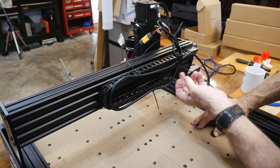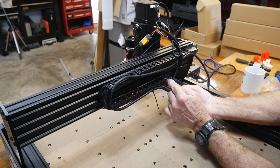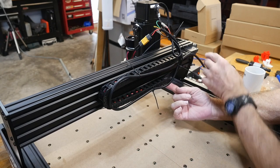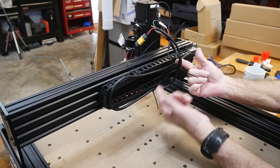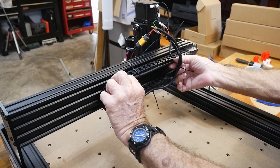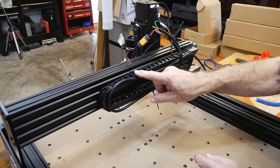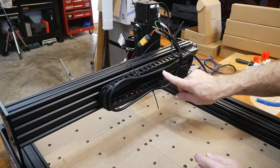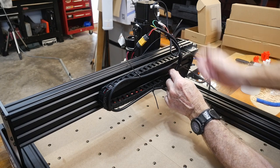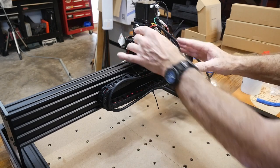When you come across the back side here, you want to come down to the bottom where the chain cable is so you can follow it by putting cable ties through the chain and come all the way back this way. It crosses over a little bit — it is what it is. I could use a couple more ties to really clean this up. I also turned the ties inward so the little pointy pieces don't drag or snag on anything. Make sure you have lots of free play so nothing running snags these wires.